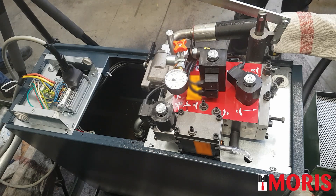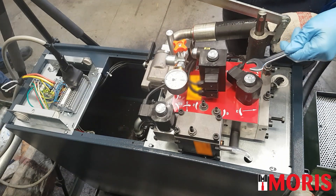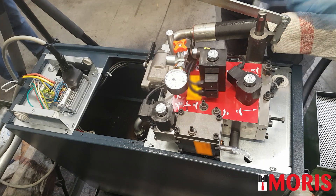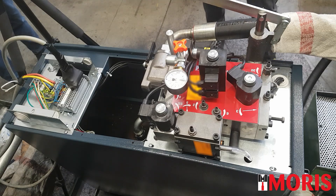Evaluate the addition of a heating resistor inside the tank. Verify that the EA electrovalve will not remain energized. You may check this by verifying the magnetization of the electrovalve with an Allen key or with an electrical multimeter. If the EA coil remains energized for the full duration of the travel, the elevator will not receive the deceleration command.